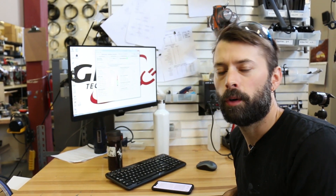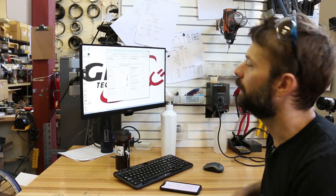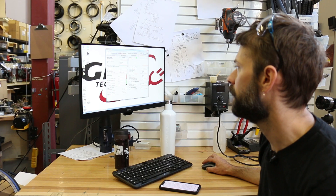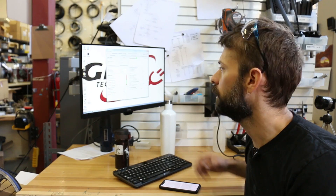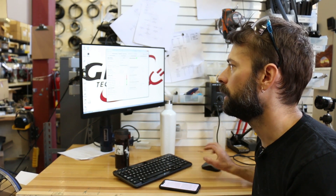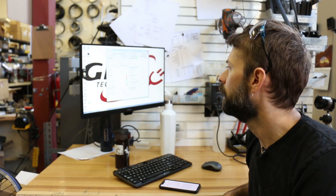Since this is a BaseRunner, the battery voltage can't go above 52 volts, and since this customer has a 52-volt battery, all we're going to do is verify the battery limits are appropriate. The maximum regen voltage parameters are here — what you typically want to do is set the start regen voltage to the final charge of your battery. This way, if the battery is fully charged when connected, you won't get a flashing LED warning. If you want to lower that value so the controller doesn't regen above the full charge voltage, that's totally fine. We typically recommend setting the end voltage at least 0.5 volts above the start voltage — one volt is also fine and gives you a bit more headroom.